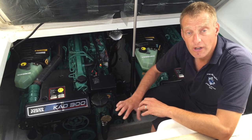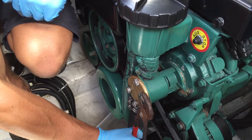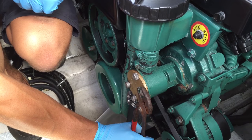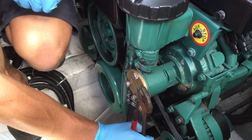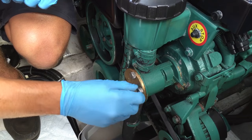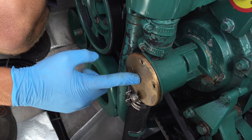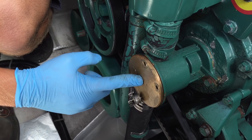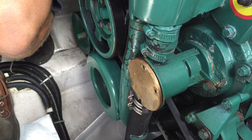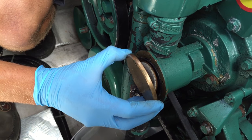The owner is really sensible — he's got thumb screws and what are called speed seal plates on the front of his impellers, which makes life much easier. Kieran is just going to loosen those off and he can do them with just a thumb. One thumb nut left and then Kieran can take the plate off. They're designed to just swivel out of the way, giving us a better view of what we're up to.